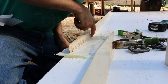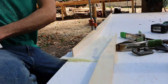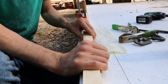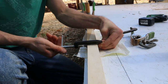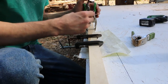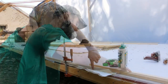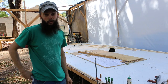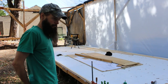After much trial and error, I've come to the conclusion that the finger is the ideal glue applicator. Slide it back and forth to get it in all the nooks and crannies. You want to squeeze tight enough to pull the joint together but not so tight you squeeze all the glue out - just until you start to see that bead rise up. With joint one done, now onto number two. Then we wait 24 hours, take the clamps off, run this long limber batten through the planer a couple times, and we should have a nice working batten.